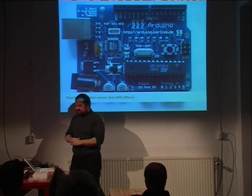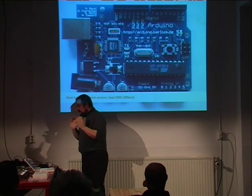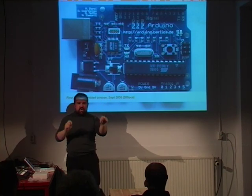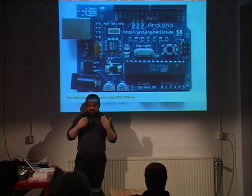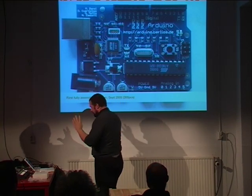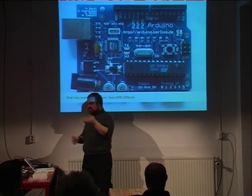It's like somebody gives you a steering wheel but you don't realize you're flying a plane until you go outside. The idea was to take away the scary part. We took off the complex notation in C to turn on and off a pin, and we used a simple syntax: 'digitalWrite, pin, on/off.' We made boards with the FTDI chip that implements the serial port — not the most efficient, but the simplest thing. We always went for the simplest thing. On this board there is practically nothing — just exactly what you need to get the microcontroller running.